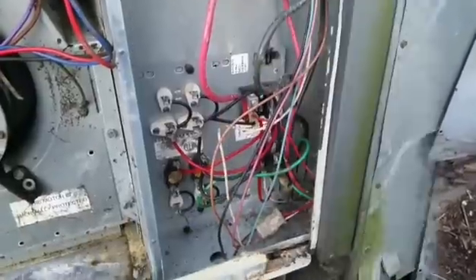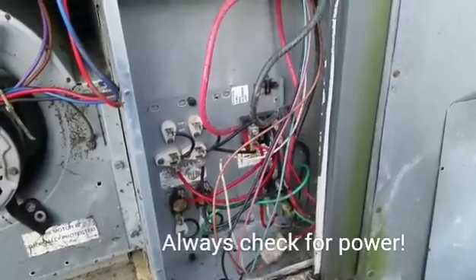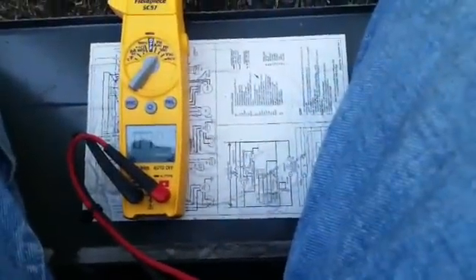A lesson for you: when I pulled these wires out, there was a spark. We need to find out why there was a spark when our breaker is off. We put our meter from ground to the bottom of the turned-off breaker and we have 70 volts to that breaker coming through — that is horrible.